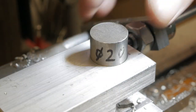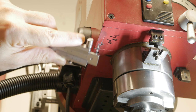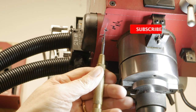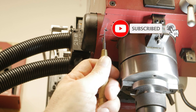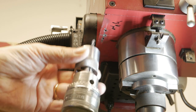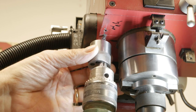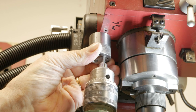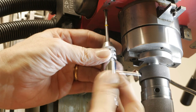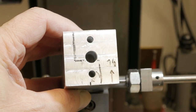I then built the central pin, using my sander device to get within tolerance. To drill the holes on the cutter head on my milling machine, I use a barrel guide that I made a few years ago, to keep the drill bits at 90 degrees as much as possible. And then I tap the holes with my M4 tap, running to a depth of 20 mm.